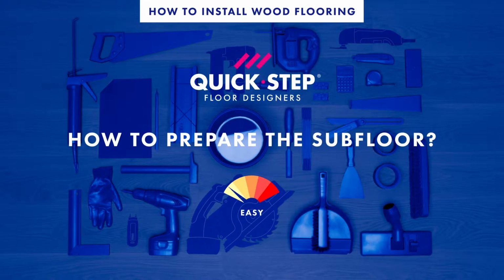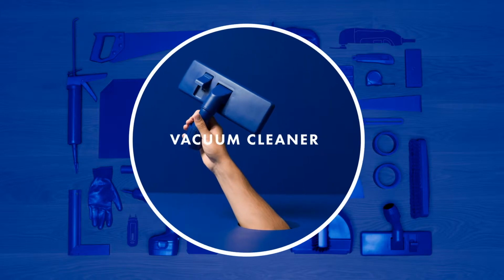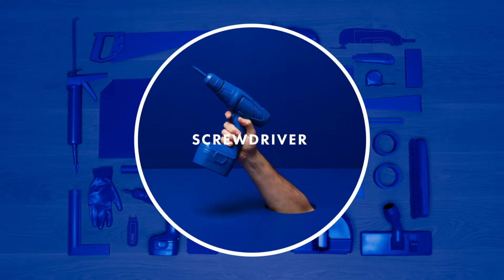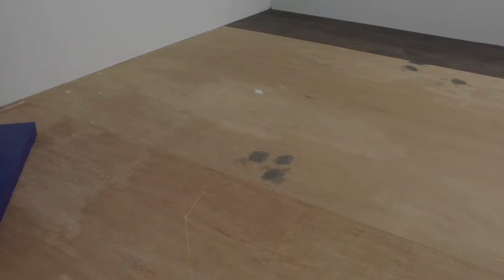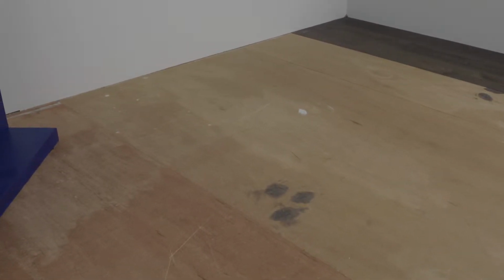To prepare your subfloor, you'll need the following tools: a moisture measurement tool, a vacuum cleaner, a trowel, a hammer, a chisel, and a regular or automatic screwdriver. The first thing to do before you install a wooden floor is to inspect the existing subfloor. Any bumps or irregularities on the subfloor will cause problems later on in the installation, so we recommend taking enough time for a thorough preparation.